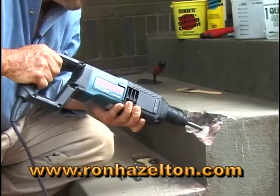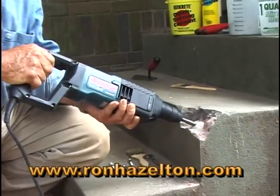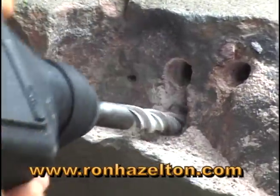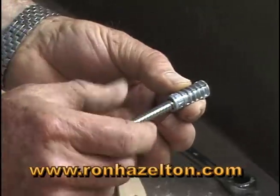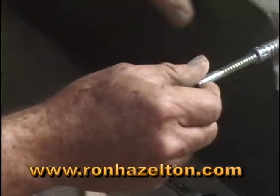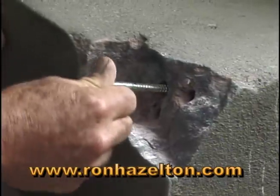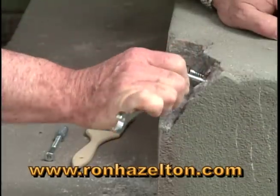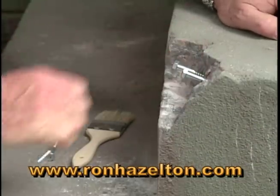To help ensure that our replacement corner will not break off, I begin by boring three holes into the step using a hammer drill. Into these I'll insert first an expansion anchor and then a lag screw to create a reinforcement post. As I tighten this up, that lag shield is going to expand and jam itself into the hole.